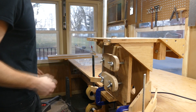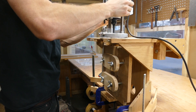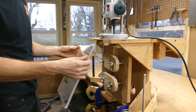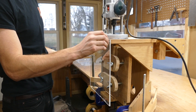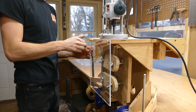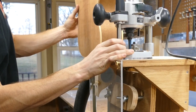Now we are ready to set the neck angle. We want to be extra critical of our measurements when cutting the tenon side. With the mortise you can be off a little without real consequences, but the tenon cut is very touchy. In fact, the weight of the router, the acrylic screen, and the shop vac hose can change my neck angle at the saddle by as much as 3/64 of an inch. So when I set the angle of the hinged board, I set it with the router, acrylic screen, and hose in place so that every factor is accounted for.